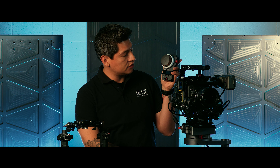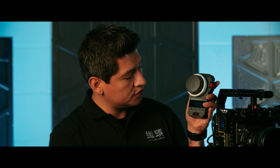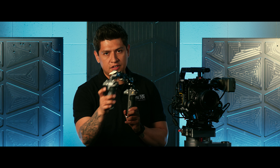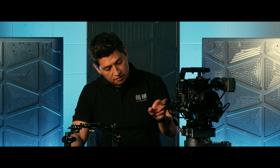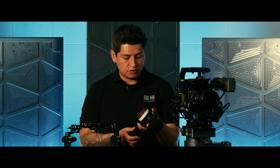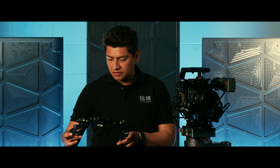Let's choose channel 5 and press enter. Now it searches for the motors and controllers — we have handle left and right and motor 1, 2, and 3, so that's been assigned. Press enter, and now the hand unit has channel 5, each handle has channel 5, and all three motors have channel 5 — but you can also see that on each motor the motor number is still the same: motor 1, motor 2, and motor 3. Checking our settings we have focus, zoom, and iris. That's the easy mode for the Nucleus M's latest firmware update — this is Walter from Tilta, thanks for watching.